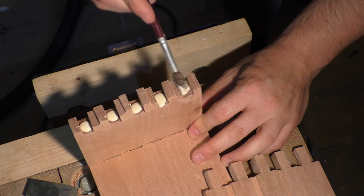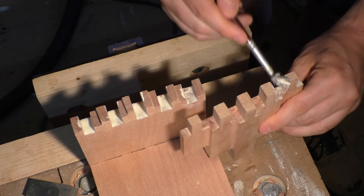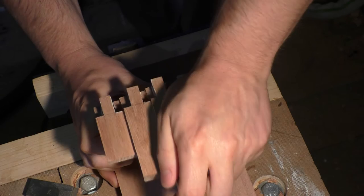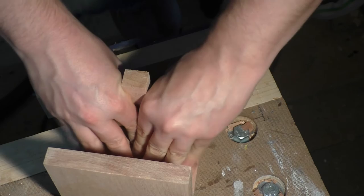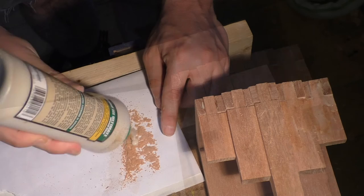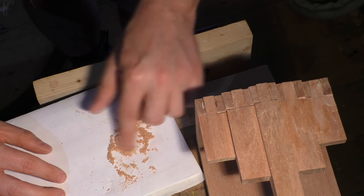With the inside sanded it's time for the glue up — every woodworker's favourite bit of the job. I decided to repair the less than perfect joints during the glue up by using the dust and glue trick. I've used this technique a few times with varying levels of success. I was confident of it working here because the wood is moderately dark and the glue is naturally a fair match. Once all the surfaces are coated with glue, put the piece together and correctly align everything before holding it in the vice. Grab a piece of scrap timber and start to make some dust using 80 grit sandpaper — you'll need a surprisingly large amount of dust as it's difficult to cram into the holes. Once you have a pile of dust, mix it with enough glue to make it workable. The less glue you use the better will be the final match to the piece. When it's mixed, use your fingers to cram the filler into the gaps. Make sure you work fast as this filler sets up quickly.